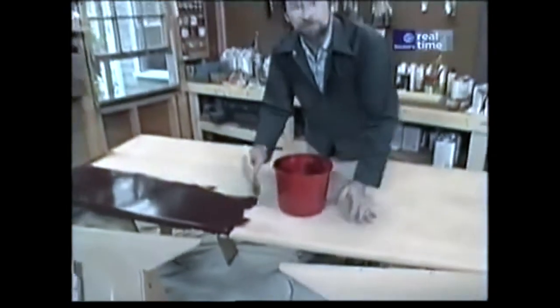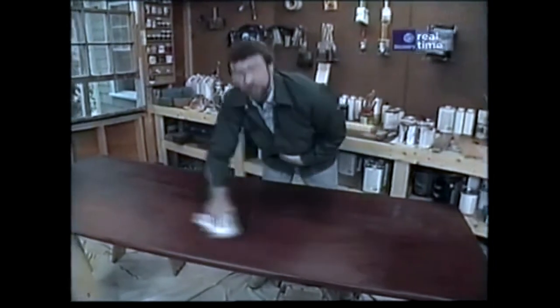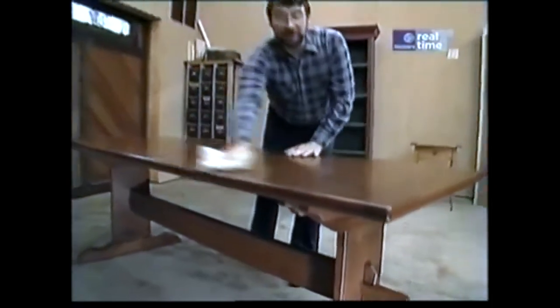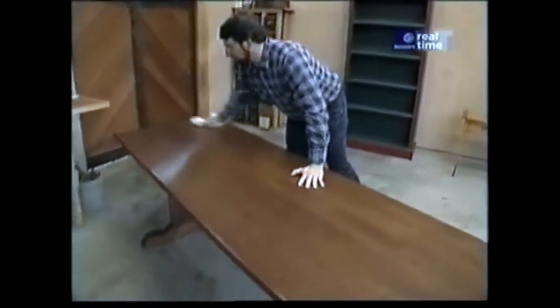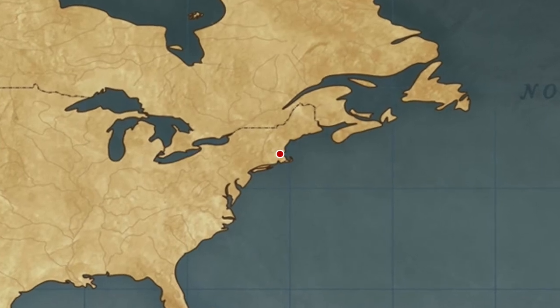One thing that was really nice about that pine table down in Nantucket was that dark, rich color. So to get the cherry a little darker, I'm going to put a cherry stain on it — I'll apply it with a brush as evenly as possible, let it sit for about 10 minutes, and then wipe off the excess. Depending on how much I rub it down will determine the final color, and I think this is just about right. After the cherry stain dried, I put on two coats of satin finish urethane with a light sanding between each coat. Now this table is ready for many a grand meal. Thank you for watching.